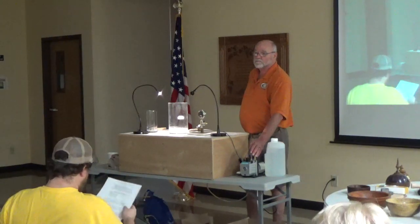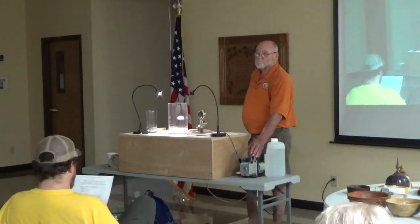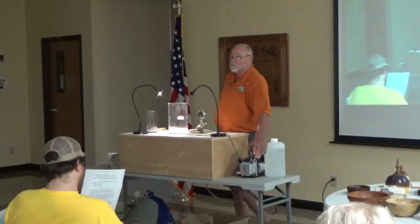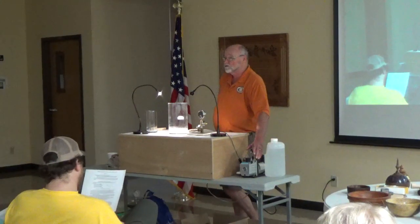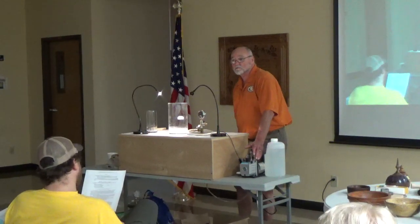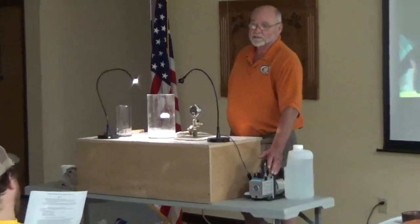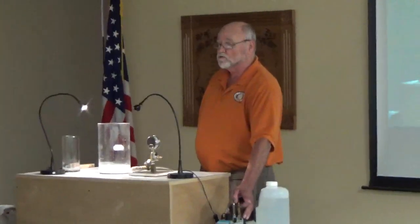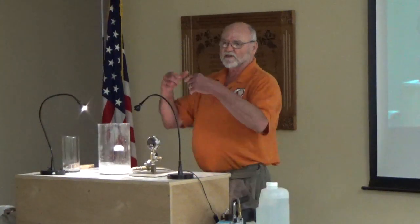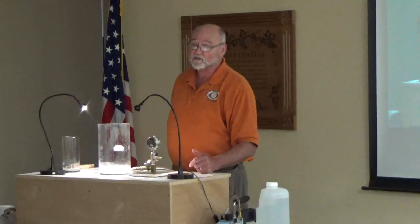You've got your diaphragm, which is what most systems use for vacuum chucking. Pretty much the most vacuum you'll get out of those is about 25 inches of mercury. It's definitely not good for doing this. Good for holding a piece of wood to a chuck, but that's about it. The other kind is a Venturi system. Those are ones you can buy at Harbor Freight, or online too. It's run by the Venturi effect, with compressed air going by an opening. I don't know all the physics behind it, but it works. And you can get close. You can get between 28 and 29 inches of mercury.